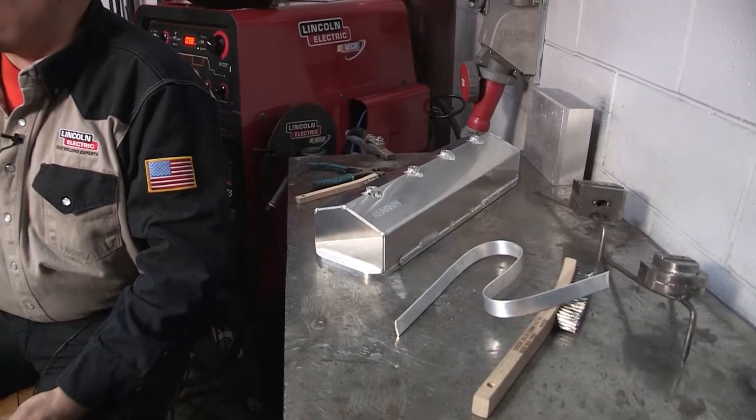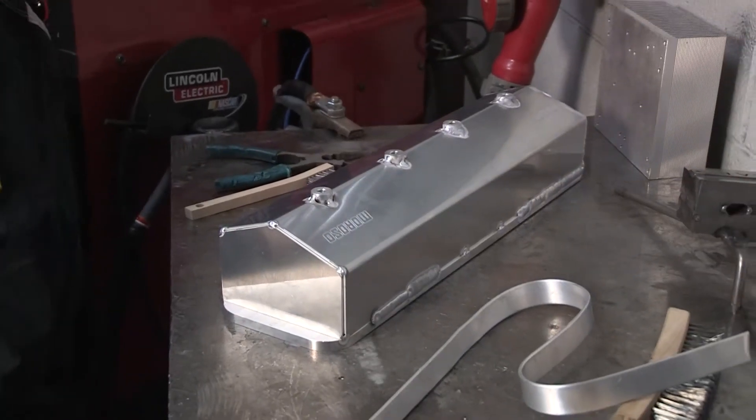For strength of the welded joint and shear strength in a fillet weld, 5356 probably has a little bit better strength, but 4043 is going to be adequate for an oil pan or a valve cover like we're working on, or even a radiator or a cooler. We're also going to look at thermal conditions above 150 degrees, and that's critical. There's a condition called stress corrosion cracking which takes place at this temperature. And the last thing is color match after anodizing — are we going to anodize this part for color to make it gold or pink or blue? We have to be careful what filler metal we use. But what's really important on this job is the thermal conditions. This part is going to operate above 150 degrees, and 5356 filler metal is not suitable for this service condition, so we have to rule 5356 out.